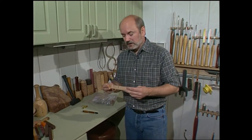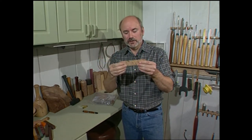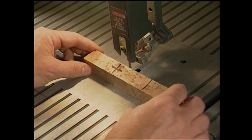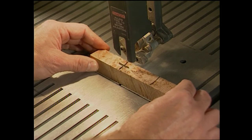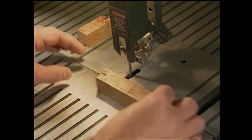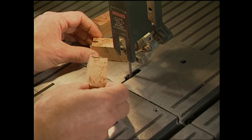If you want to make a bunch of pens at one time, make sure that you mark these blanks 1 and 1, and the next one's 2 and 2. That way, you keep the pairs matched and together. Let's go to the bandsaw. I'm not too worried about being very accurate, but I do want to make this cut fairly straight so I won't waste very much wood when I match the grain. And don't throw the offcuts away — you might find use for them later.